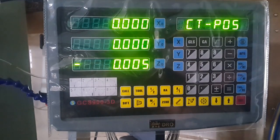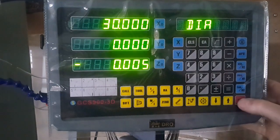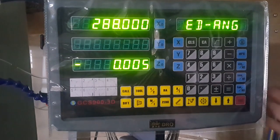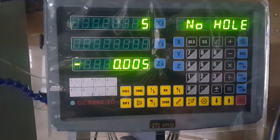Now it's asking for a diameter, which I've already put in — 30 millimeters. It's going to ask for the start angle. Like I was saying on the calculator, we're going to start at zero, so it's going to be top dead center of that circle. Then for the end angle, from that calculator we pick the last angle, which was 288 degrees.